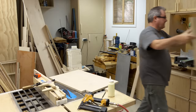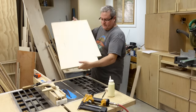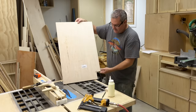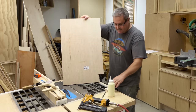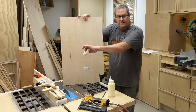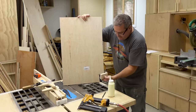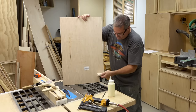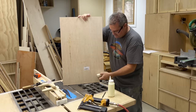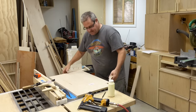This is the outside panel and this is the inside panel — the one that goes against the wall. You can see when I made the cuts on the table saw there's a slight overcut. In normal circumstances you want to avoid that, but if you were building this with open cabinets that have doors and shelves, the bottom shelf would cover that overcut, and the one going the other way you'd never see anyway. Since I'm putting drawers only in this cabinet, it's not an issue at all.